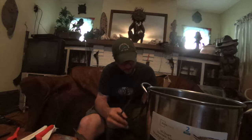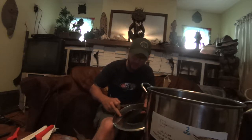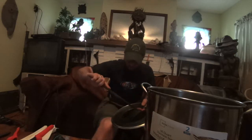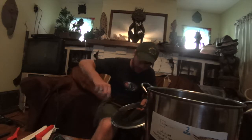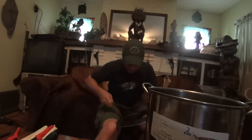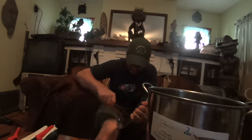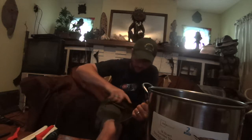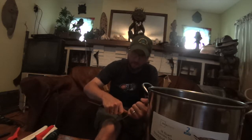It's pretty darn sharp. I'm going to go on this side again, do one more pass on a flat angle, try to get rid of that burr, and then I'm going to take a stone, sandpaper, or even the side of the file and go in the direction of the grain. Again, slightly curving like this and just trying to take that edge off. You're going to hear the edge difference. It's because it's going against that complete end grain. I'm really just trying to dull this up.